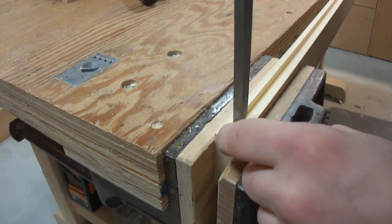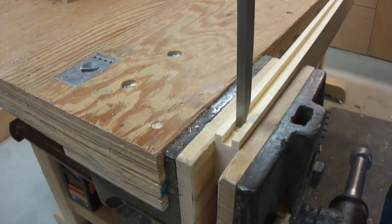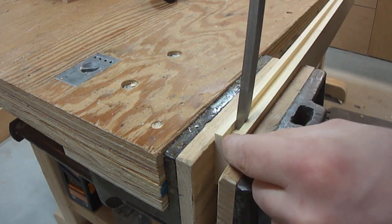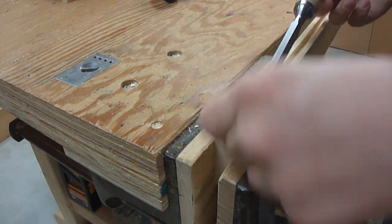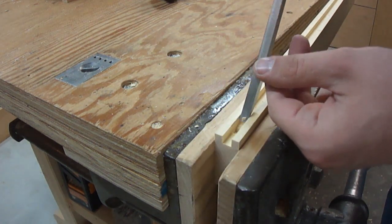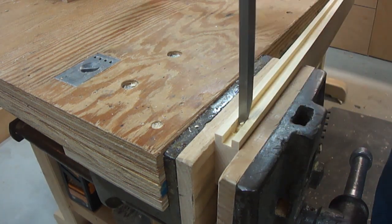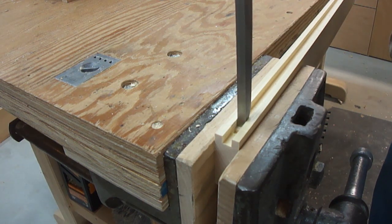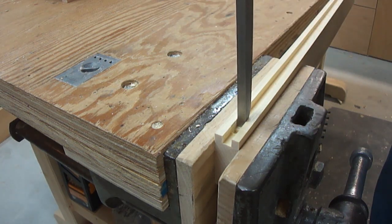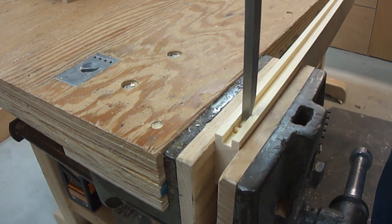And if you notice, it moved that little piece of wood. So, if I repeat the process again, it just moved another little piece of wood. Now I can go ahead and lever out that little chunk of wood and the previous chunk of wood. Each time I do this, I'm going to get a little chunk of wood. Also, each time I do it, the chisel goes slightly deeper. I'm going to keep going along in this same manner until I get to the other side.